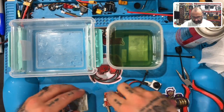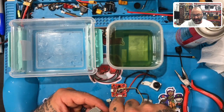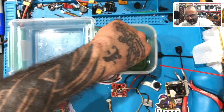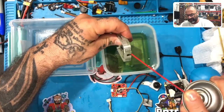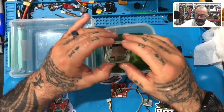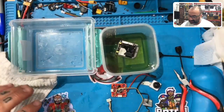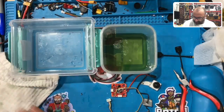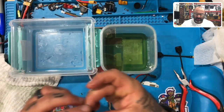At the very least you can pop the ribbon off, then place it in and spray it — just like that. Get into every crevice: the USB port, the plug, everywhere you can. If you have time, take the board off and get underneath it, but there's thermal paste under there. When you're done, let it sit for a minute or two; it doesn't take much longer than that. Put the other piece in and spray it as well.